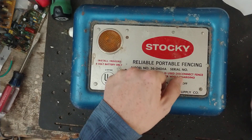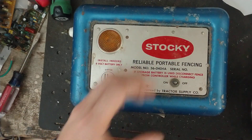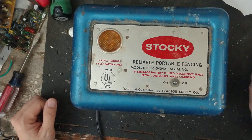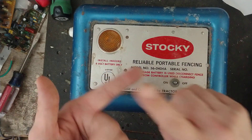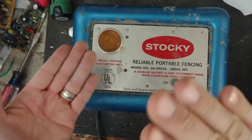So we're going to flip the switch on. It has a little light here. This is a mechanical one — it's a little wheel that puts some points on it. It still technically works, though the transformer is arcing on the inside. You can't get any parts for this thing anymore. In the little wheel where the points make contact, they've got a little crust, a little tarnish on them, so they arc every time they make contact.